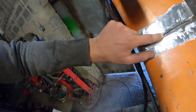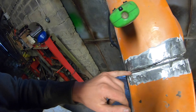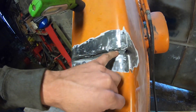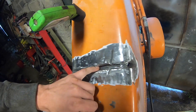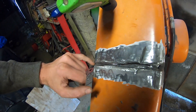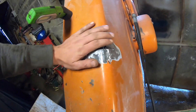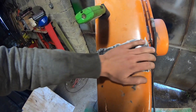I'm going to get stuck into warming this up and hopefully get a filler rod into this now in a few minutes — get the bottom of it filled up. There's a plate underneath this, as you can see, so I'll make use of that to get my weld built up. I'll probably build up this wide section first, then get the lower section done, then get a filled section across just this wee bit, get the whole lower part filled up, ground out nice and tidy, and ready to start building it up. I'm going to get some gas at it, get it warmed up, make sure the steel is nice and supple for the rod.